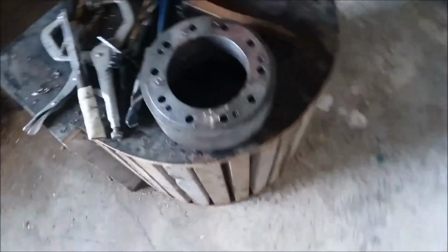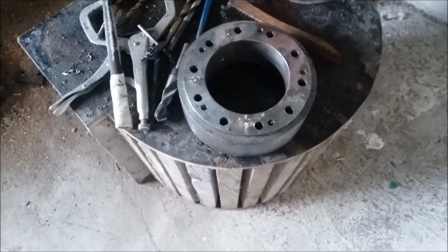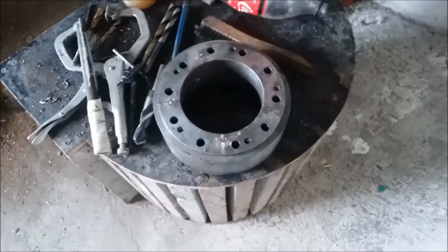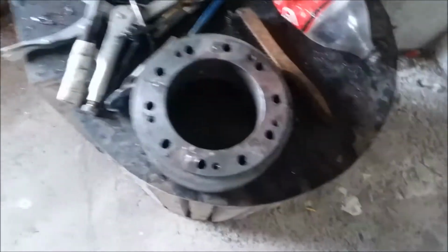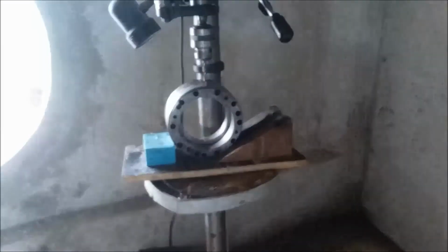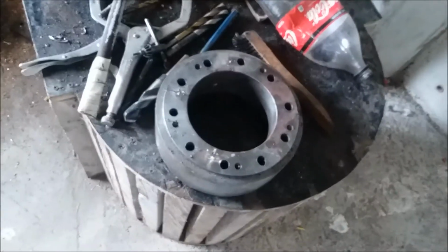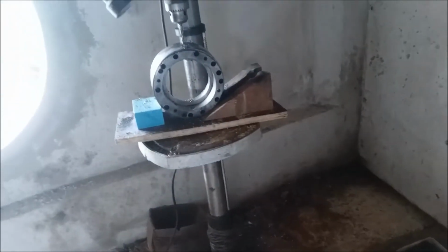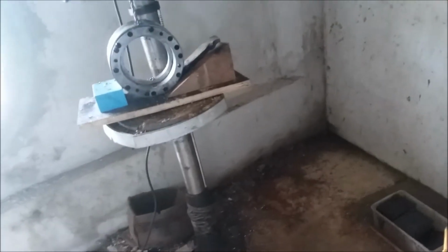And there he is. This gets a 6461 and a 6462 Timken bearing. It's a bigger bearing. Goes on top, and the weight hangs on that. But you can't run a Timken bearing by itself. It climbs out of the race. So that's why we have that one that's sitting on the drill press. The Timken bearing is to load this Timken bearing, and the spherical bearing is for radial loads from the fan. Just those. Doesn't shake the whole building.